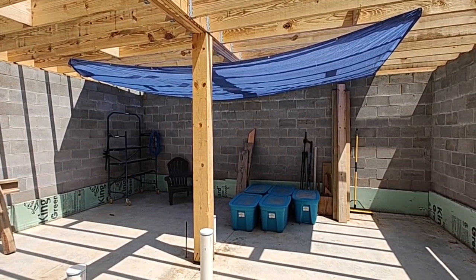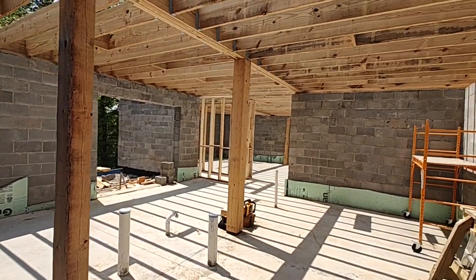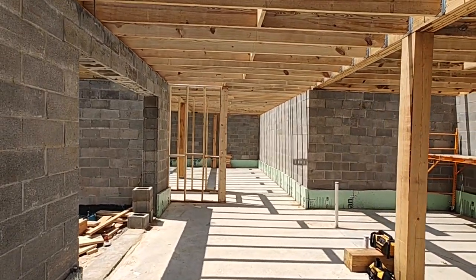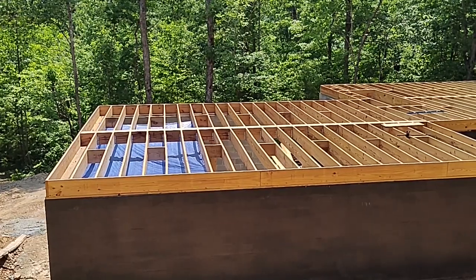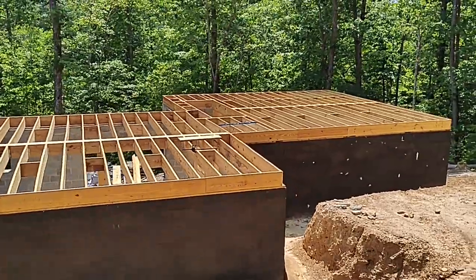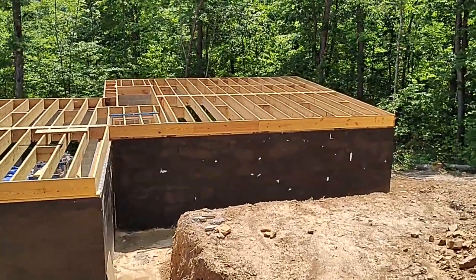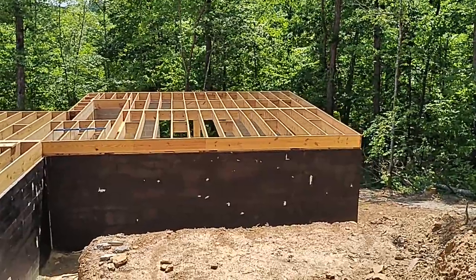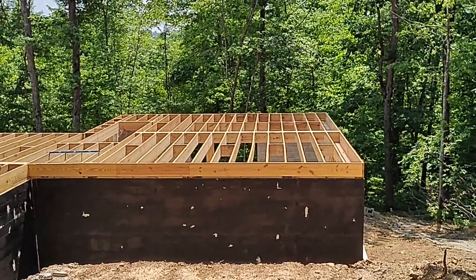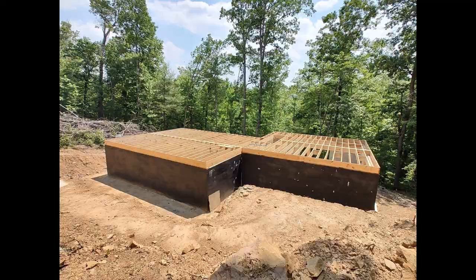While I'm anxious to get started on the subfloor sheathing, I will be doing the stairway and door framing next — it just means less time for the subfloor to be out in the weather. I have it on site, but the longer I can wait while doing other things, the less time it's exposed to weather while I'm drying in the rest of the building. Here's an overview — everything's complete. You can also see there's a slight angle between this section and the other section, kind of pigeon-toed by about five degrees. There won't be any visual evidence of that once the house is built, but as discussed in earlier videos, the foundation wasn't perfectly square and that's what we needed to resort to — ultimately it won't cause any real issues. Thanks a lot and see you next time.